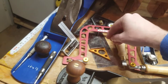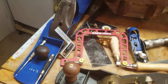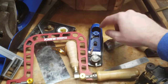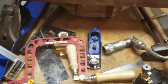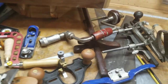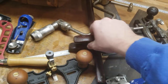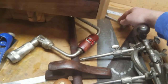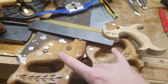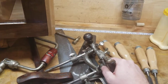The Bridge City Tool Works square for smaller stuff. I use the card scraper a lot — I've never used the card scraper so much. The rule just as a ruler. My block plane I used an incredible amount for trimming — it's a low angle block plane used for trimming. Dunlap brace for drilling the hole. The panel gauge for making the edges parallel. Hammer for adjusting the block plane. My two big hand saws for cross cut and rip, breaking down the lumber.